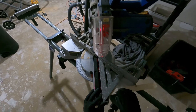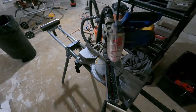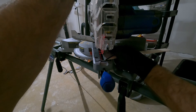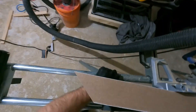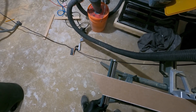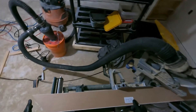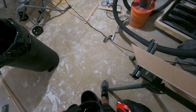Something I'm doing here that's a little different from last time is I've raised up this corner with a little shim — it's pretty close to exactly the same height as the back, and this will help the angle be a little more accurate. But it's still a bit of a fuss trying to get these lined up exactly. This time we're going to cut to the inside corners, which is never the most fun for me, but we're showing the other way people do this. We'll get the board right on the edge and hope this doesn't move — we can tighten that down. This is why I don't like doing it this way. We'll try at 21 and 5/8.